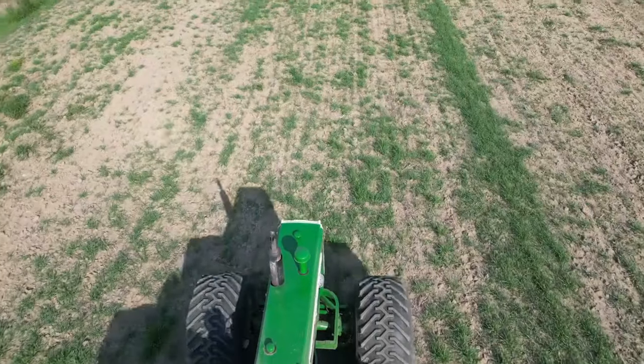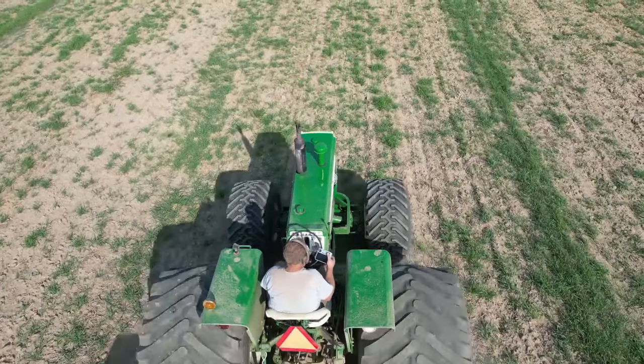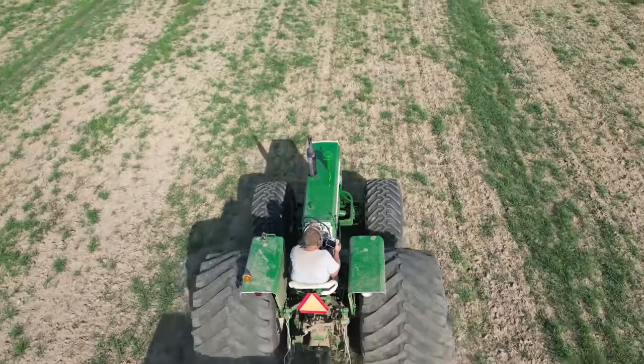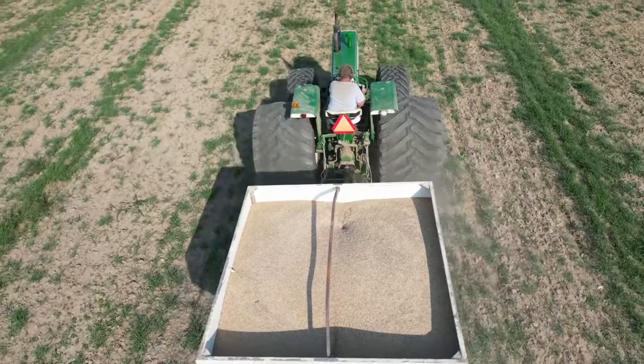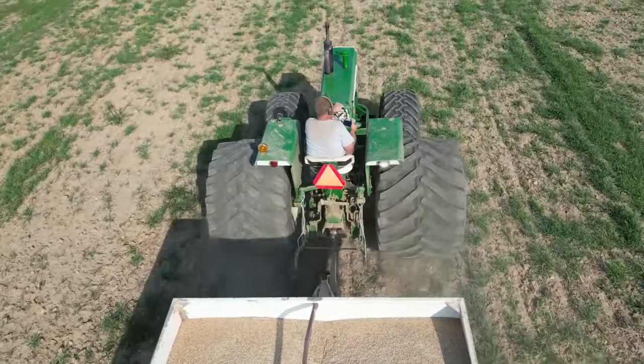I tried with the skid steer, then I tried the backhoe, pushing down on the bead on those. And it wasn't until I finally took a hole saw, cut a hole just above the bead, then went in with a torch and torched off the steel bands inside the bead. And when that last steel band popped, then it released from the rim.